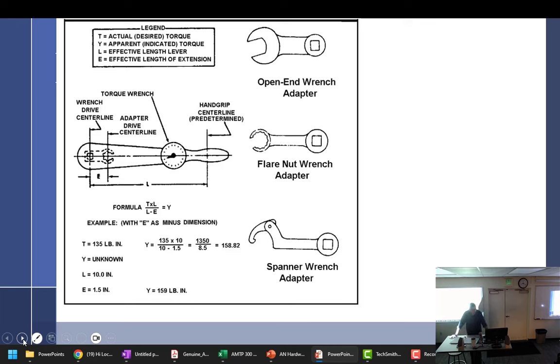All right, if necessary, we have to add friction torque to torquing. What is friction torque? The friction from the nut rotating against the bolt. No, that's the final torque. So maybe you have a self-locking nut that takes 10 inch-pounds to turn. That's your friction torque. Whatever it takes to get through. So if you're using a nylon nut, it takes 10 inch-pounds to actually screw it on, and you're supposed to torque to 50 inch-pounds, what's your final torque? 60. Yeah, you got to add that torque.